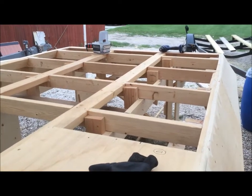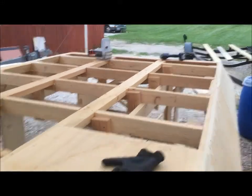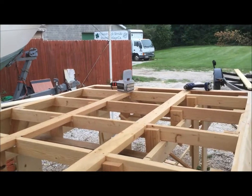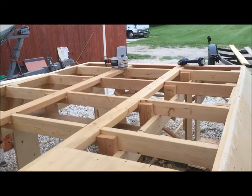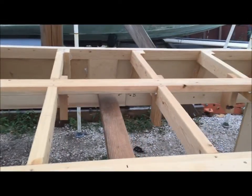As I get pieces done I'll show them to you. The last small piece in that front corner I'll probably film so you can see what's going on. One more quick note: you can see the frame members going across — I need to screw into those. It's hard to figure out where they are from this side, so I'm going to mark both edges of each frame member with a marker, then lay a straight edge across and draw lines so I know where to put the screws.